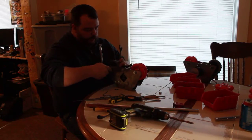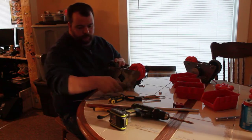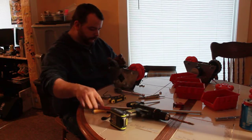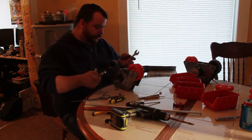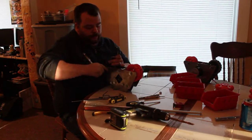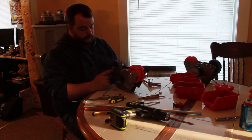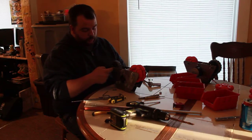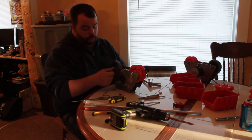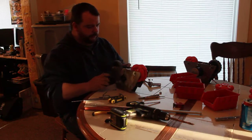This one down. Try to keep tension on the chain. You're just going to pull back on it. You can smack it with a hammer or a pair of pliers, just enough so the chain is tensioned. We did not invent an auto chain tensioner in this. Technically, you could, using turnbuckles and a big washer, and then weld it to a bolt that goes into the turnbuckle, then goes into a screw right here, and you can turn the turnbuckle and push it this way. And you really only need it on the one side, just something to hold it. But this seems like it works alright, so time will tell.